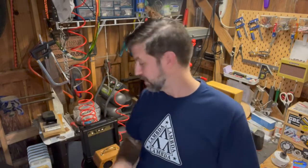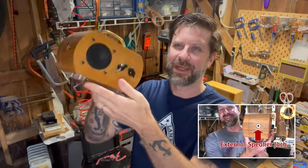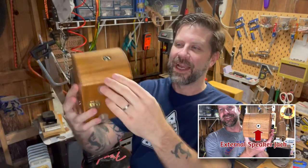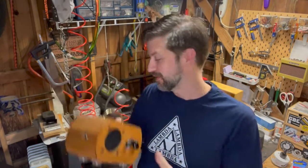Time for another DIY project today. And today's video comes from some of your comments on previous videos. So if you're a subscriber, you might remember when I did this. This is a jewelry box amp that I made out of a jewelry box kit. And I added this jack here, which allows you to use it as a head. So you can use the internal speaker, or when you plug in here, it disconnects the internal speaker and you can plug it into an external cabinet.